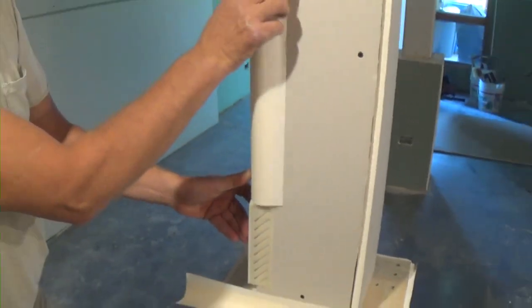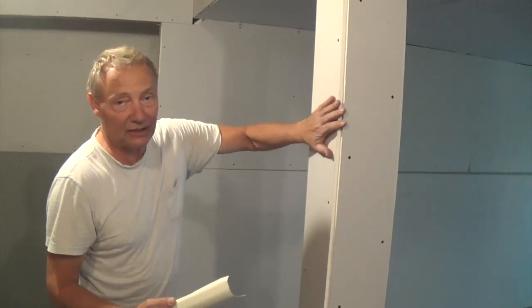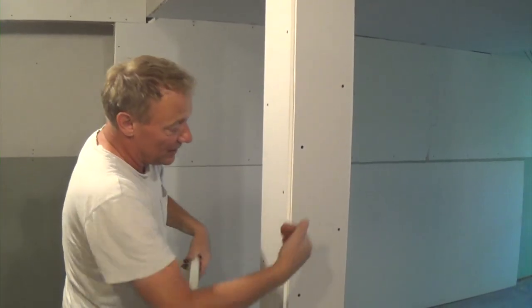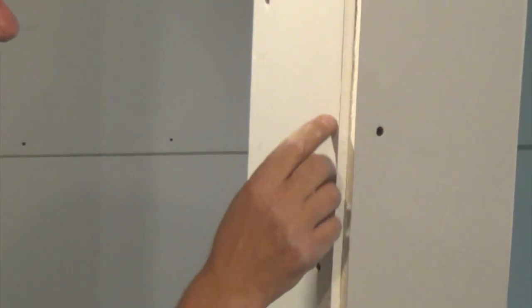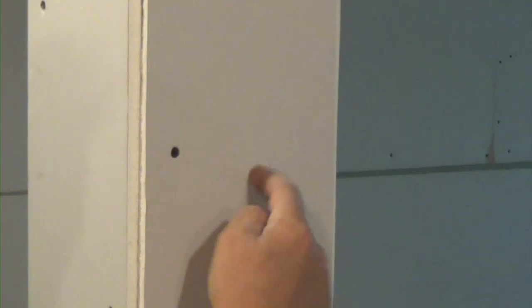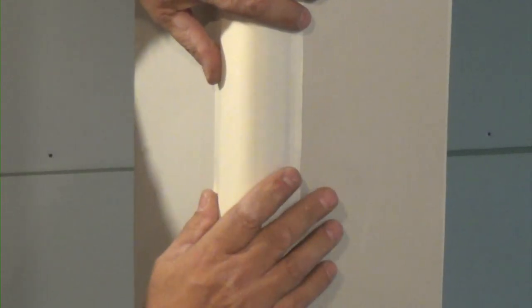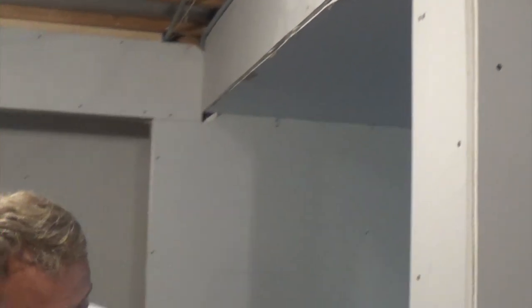The most important thing about bullnose is how this corner bead is hung — how this is drywalled. This is not good for bullnose; bullnose is going to rock on this. You have to cut the drywall back, you have to V this back. A lot of times I'll just stop it short — stop it a half inch short of the corner. So if this is seven inches right here, I would make this six inches. If it was getting bullnose, trust me, the bullnose goes way beyond it, it can't ride on the corner. So that's the most important thing about bullnose — make sure that drywall is cut back, otherwise it just doesn't fit properly.